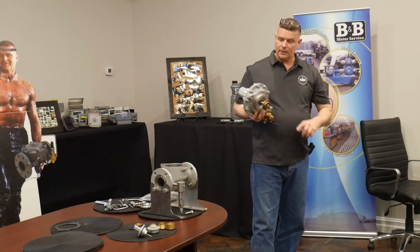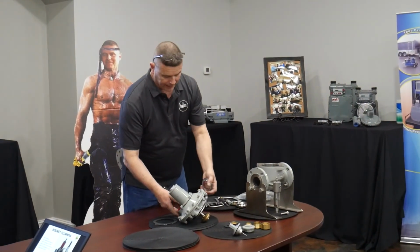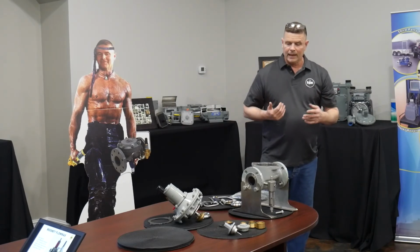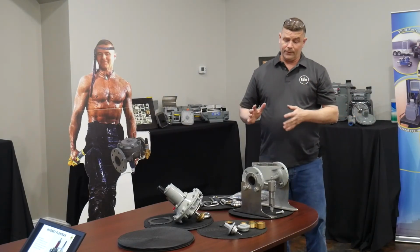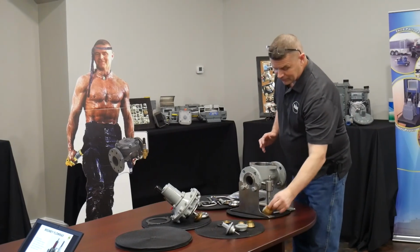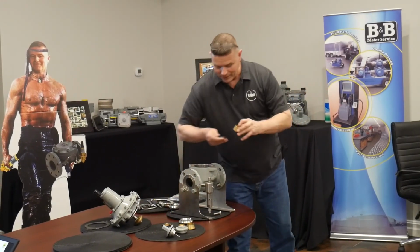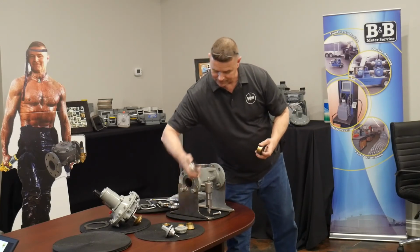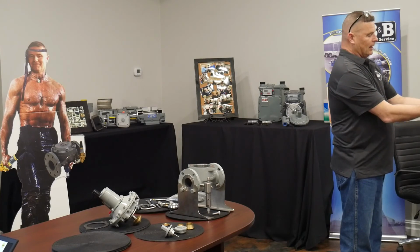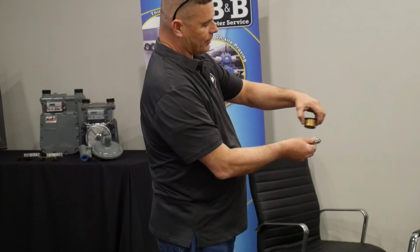So this is very popular with trying to use these as regulators in systems where we have quite a variance in flow. If I need to worry about relief with these and I need to trim down some of that high capacity because I don't need it all, this is a 25% capacity plug retainer. So when it goes down in the orifice, it never comes out all the way. The lift is really about a half inch. Never leaves, and whatever the 25% is flows around it.